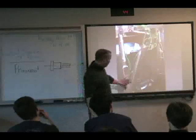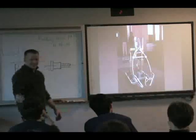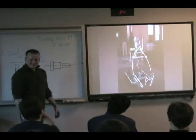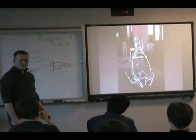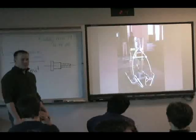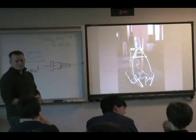Here's a different view. You can see that big long cylinder. That's the one that they were having all the trouble with. This is anybody's? No, it's Amy's. Mine. Did you want to say anything about it? I was just going to say, we had problems because there was a cylinder on that backside that lifted the entire front arm back up, and we realized too late that, based on wording, our diameter was too big on our cylinder. So just make sure you're following the rules when you're doing that. We really didn't have any other problems with pneumatics except that we had the wrong size cylinder and had to redesign it in 3 days.